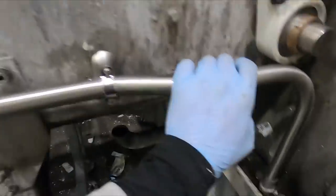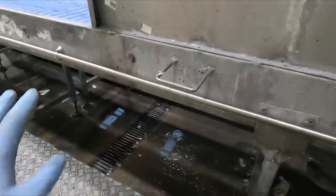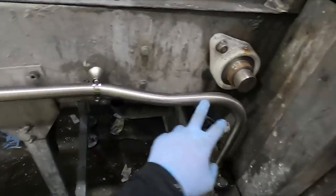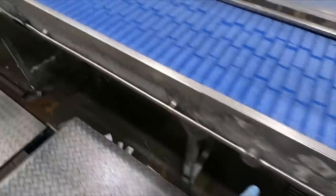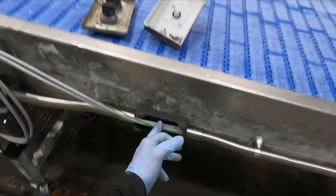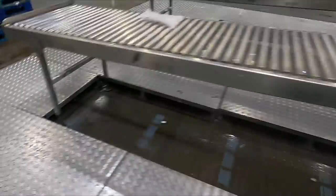We've also done a bit of galv, we've also done a bit of stainless. So yeah, it's been hard to bend, but it's not too bad, to be honest with you. We've had to do some sets to get round stuff like this, but then yeah, it comes in, we've got a through there, and then this is going to be the stop start isolator. There'll also be an emergency stop in the middle here. We've got one more bit of tube to do, a couple of other bits actually further down there as well.